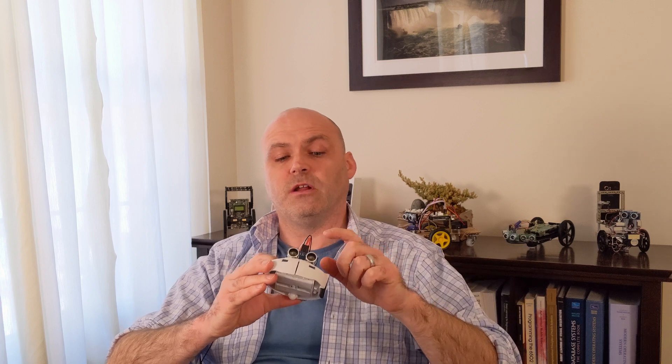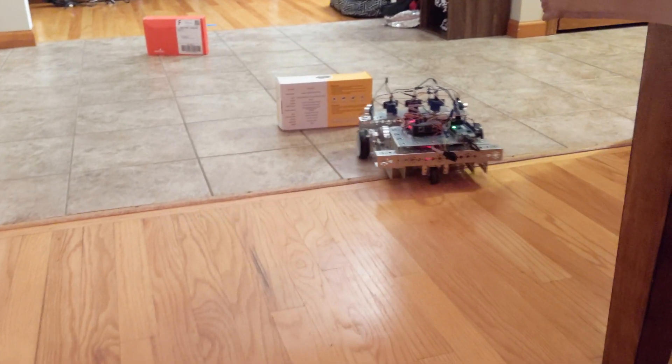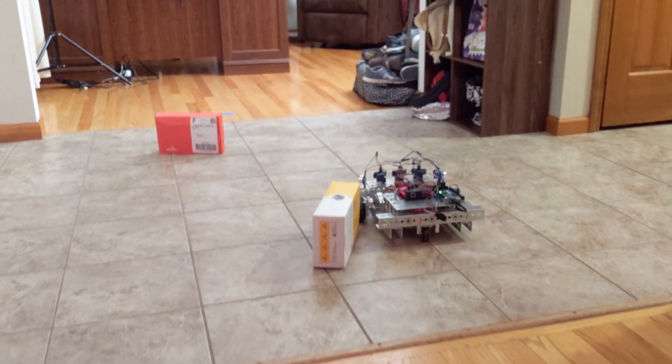There's more content coming — next we're going to work on a wall-following behavior. I'll add a servo here to control the orientation of this ultrasonic sensor, which introduces new problems: we'll need to know the sensor's orientation relative to the robot, which means we need to know the robot's own orientation. That's all coming up soon and ties into the go-to-goal behavior as well. Thanks for watching and I look forward to seeing you next time. No robots were harmed in the making of this video.